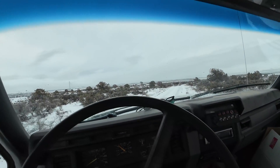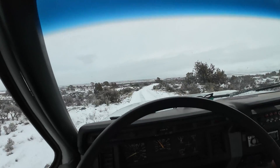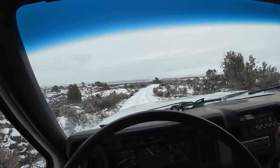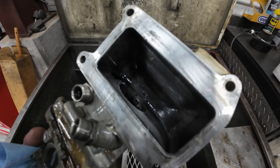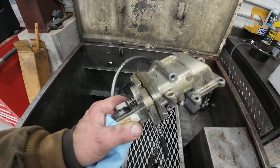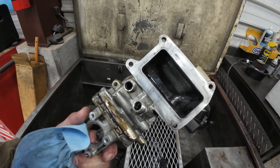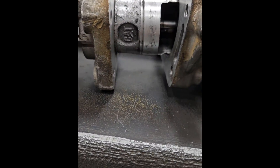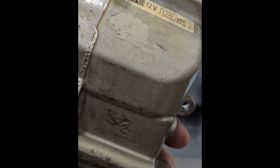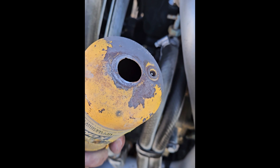So we're going to take it home and clean it all up good. Hopefully tomorrow's a warmer day. Get it all back together. Hopefully this cures it. This is EGR on a 420F with just passive regen, and I can't get this valve out of the housing. I got it to move a little, but I'm going to ruin it — I'll probably end up buying a new one: $600 from my dealer. Cat was so proud of this EGR valve they had to hide their name on it, put it inside so you didn't know who made it. The ether injector quit working — could I just pour more ether in this hole and put that can back on there?